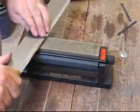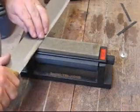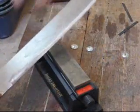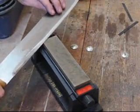The blade is already sharp enough to cut, so you've got to be careful at this point. I'm sharpening a machete blade — they're long blades, so you have to sharpen them one section at a time. For the longer sweep of the convex edge, I like to angle the stone a little bit and then just put a micro bevel all the way along the edge.